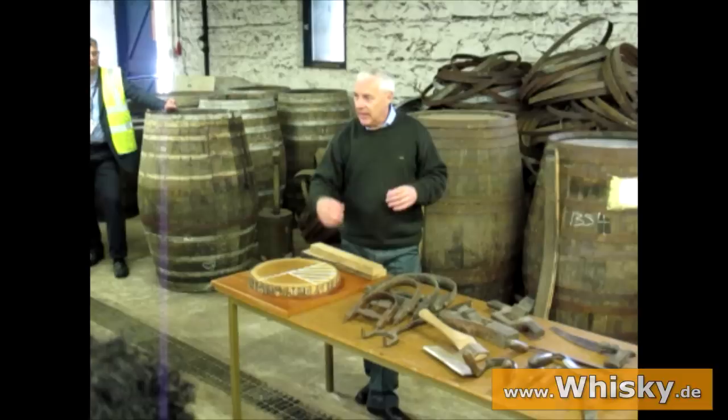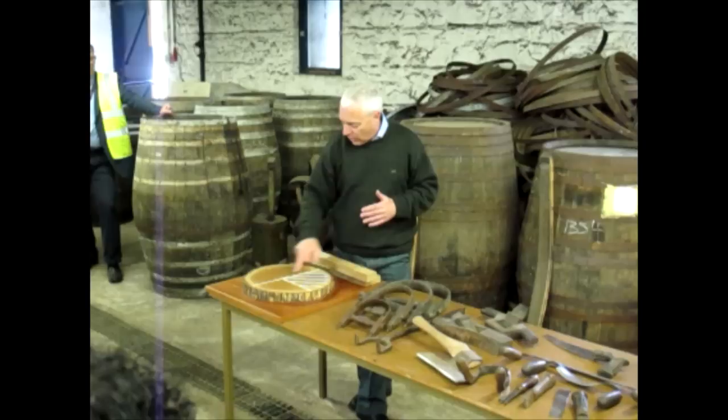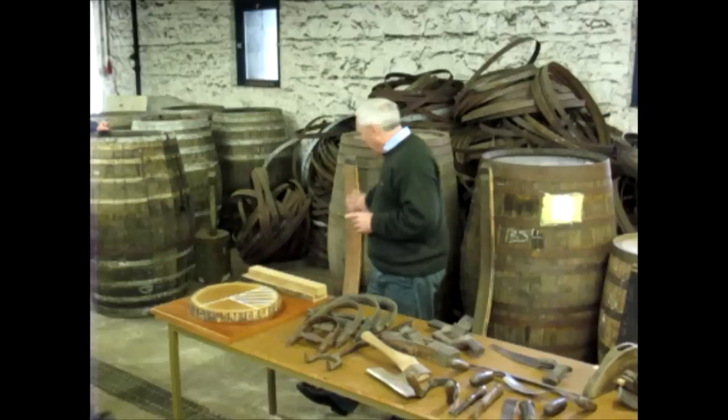What I have here is an American oak ring. It's specially cut when you're making a cask — it's quarter sawn. The log is cut to length, then split into quarters, and the boards are cut at this angle. What you're trying to achieve is to get the rings at 90 degrees to the board. When you do that you get a lot more strength, and you need all the strength you can get in your timber so that when you bend the cask to form that shape, you don't get cracking.